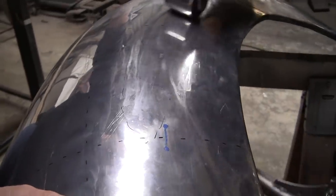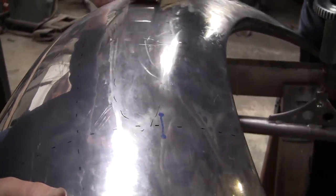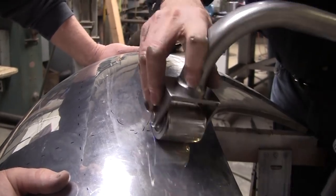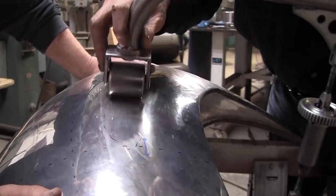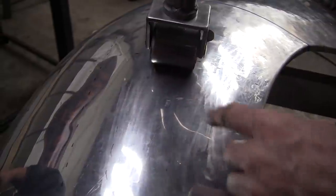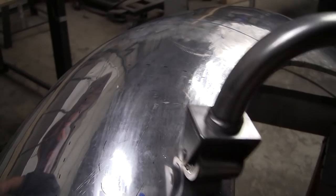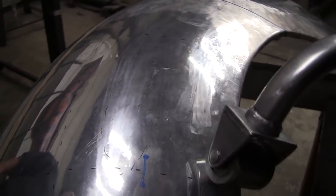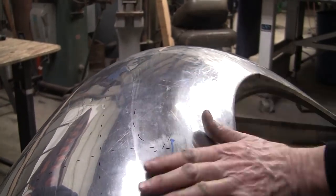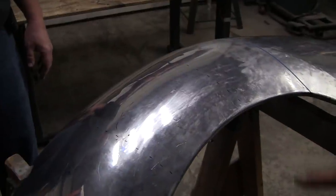It's working really good. That was really low pressure, and because that dent was so big, the top wheel bit in a little bit, so it had to be sanded — it left a little bit of scarring there, but that'll sand out easily. You can see the advantage of being able to turn the wheels at an angle — that smoothed out really nicely. It probably could stand a little bit of work up here, but it's nice and smooth again. So that's aluminum — that was 060. Now let's try a little dent on a steel panel.